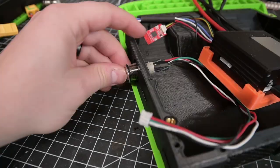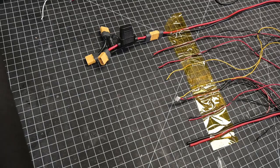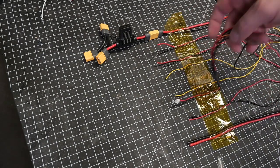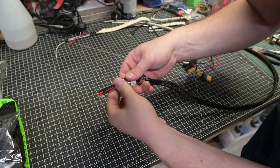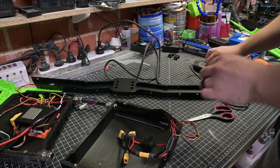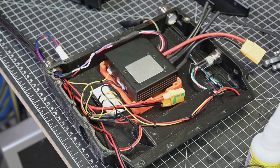The electrical architecture of a DIY Onewheel varies case by case. As is common with FM Onewheels, the on-off switch and charge port are located in the front box with the controller. As such, to use protected cabling, you must connect the charge port to the battery in the rear box and the battery to the VESC. In my case, I added front and rear WS2815 LED strips, controllable wirelessly via WLED through the inclusion of a separate ESP32 dev board, which means even more wiring.